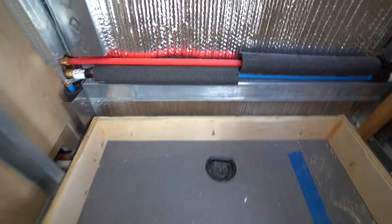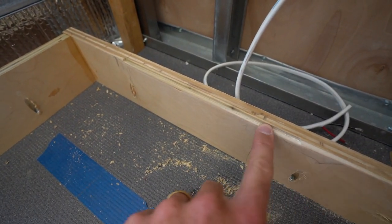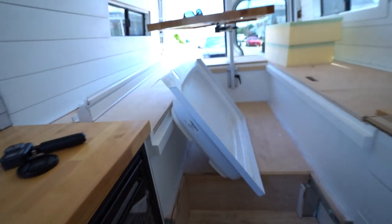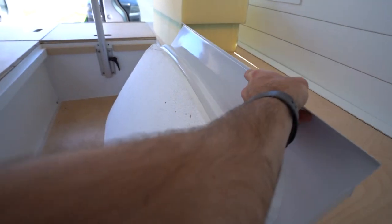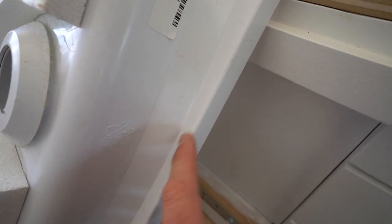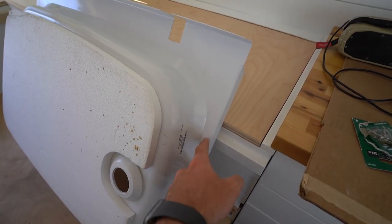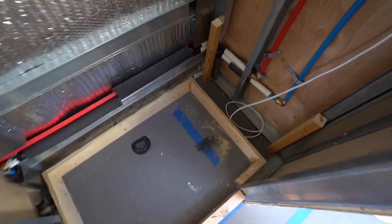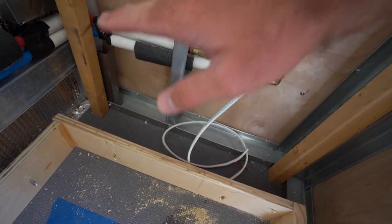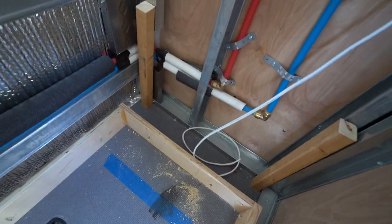This frame is not going anywhere. I also had to route out the middle of each side because the shower pan sticks out a little too much — it's probably about a half inch. I wanted the most structural foundation or support, so that's why I routed it right in the middle. I'm also going to have about 4 to 5 inches back here for extra space, and I'm going to build a little shelf so we have a step to put our foot on — to shave your legs, clean your feet, whatever you need to do.